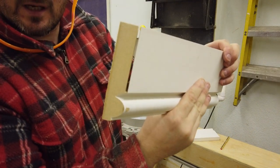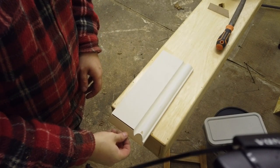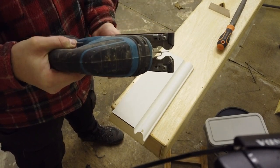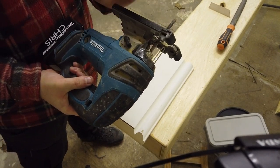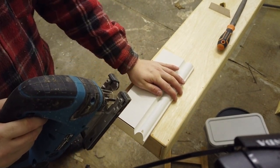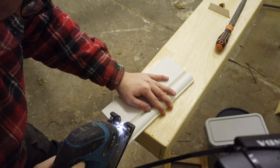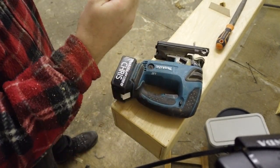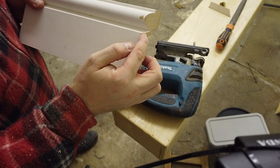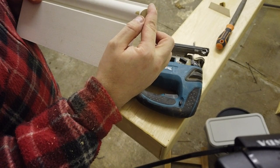Then we cut down to there just along that line, and then we're going to go over to the jigsaw. We're going to use the jigsaw — not with a coping sled like some people have — so we're going to cut it from the top and back cut it as we go. You can still see some of that bare MDF there, but we don't want to actually touch the line because we can't be that accurate with the jigsaw, so we're going to file that off after and get it nice and smooth.